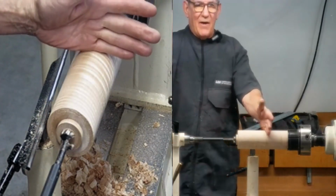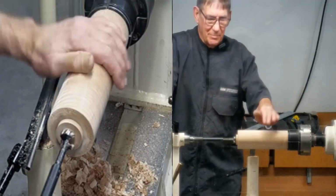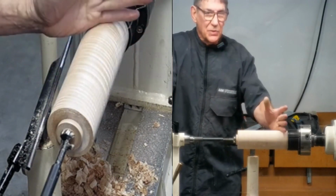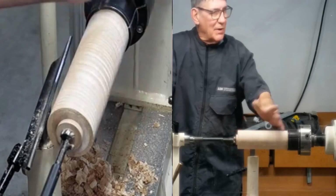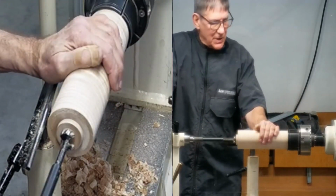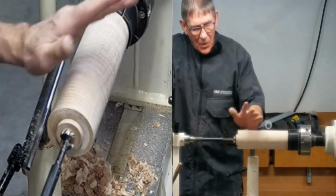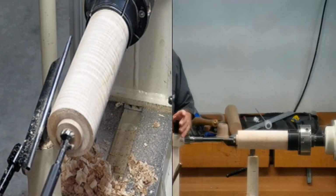We only need to drill halfway. Don't sit there and kill yourself going miles down into this. It's easier that way. Your drill bit will start to wander. Sometimes wood's harder here in spots, so you want to drill it from both sides. So this is our top half. This is our bottom. We're starting to drill this one first, for no particular reason.